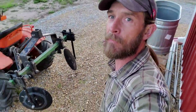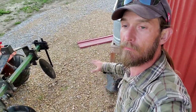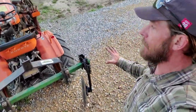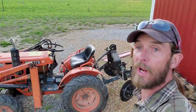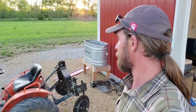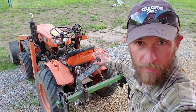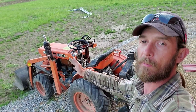So in just a few minutes I went from my original cultivator — which is a double-row, seven-tine with sweeps — to a hiller, all with the same toolbar. That's why this thing right here is literally a game changer for anybody that has a small farm and a small tractor. I've got a little baby tractor — it's my grandpa's old Kubota, a 1979 B71, 16-horsepower tractor. The inside of the wheelbase, after you move the rear tires out, is 30 inches. It goes over a 30-inch bed perfectly with no problem, and the tires are thin so there's nothing to worry about. You can actually run down an 18-inch walk path with a 30-inch bed, spaced on four-foot centers like usual.